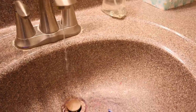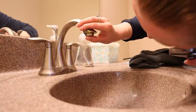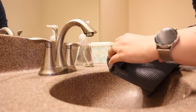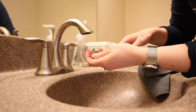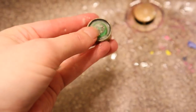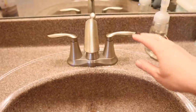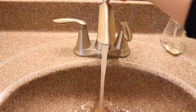Speaking of baths and bathrooms in general — in a recent video I had a tap where the water pressure was almost non-existent, due to a build-up of sediment and dirt right inside the tap head. A great way to get rid of that sediment and limescale is to fill a little plastic ziploc bag with some vinegar and then tie it over the tap, making sure that the tap head is submerged in the vinegar. Tie it up with some elastic bands and leave it there overnight. The vinegar will help to break down all of that limescale and general grot, so you shouldn't have a problem with water barely dripping out of your shower head.